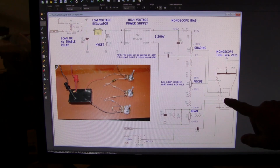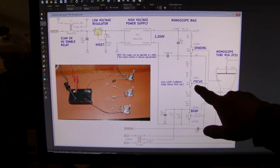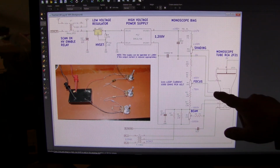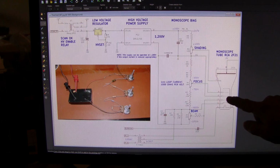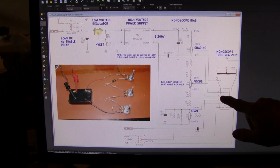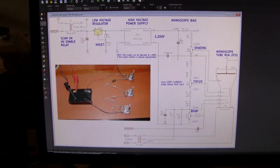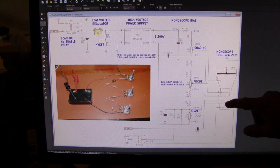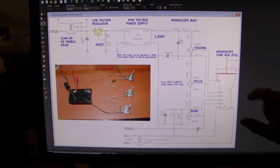The remaining electrode is the focusing electrode, which operates at a high voltage of about minus 700 volts here and plus 300 volts relative to cathode. It's adjustable by plus or minus 50 volts so that we can focus the beam. It operates in a way that a charge is formed between the second anode, which is two pieces, one on each side of this. These are cylinders, not grids. And this cylinder sits between the second anode cylinders and forms an actual electron pinch point, which behaves exactly like an optical lens, which lets us focus our beam to a spot. So that is the general operation of the tube, if you can imagine it from this schematic symbol.